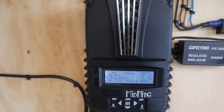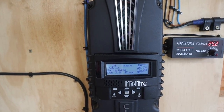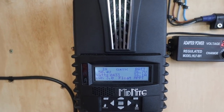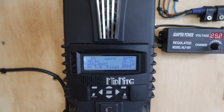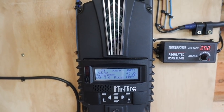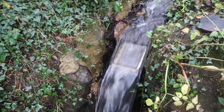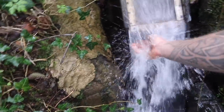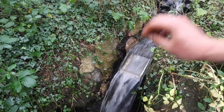We're seeing 440 but it looks like we're draining the pipe now. It hasn't rained for a couple of days, the stream's a bit low - not low but there's not enough water to sustain it. We can see it's slowly dropping because we're slowly draining that pipe. We'll have to do a full power test once we've got a little bit more water in the stream. Running at 380 at the moment. I'm just off at the intake - I think we might just about have enough, maybe a litre and a half spare. There are a couple of leaves on there that might be restricting it.